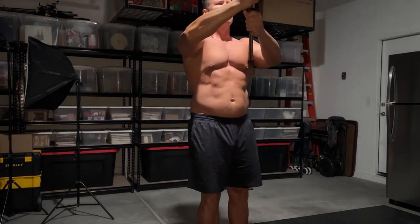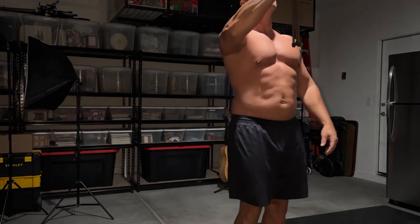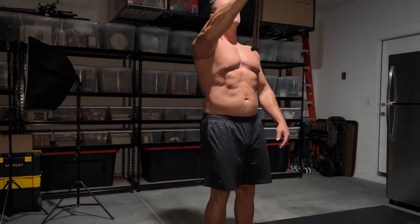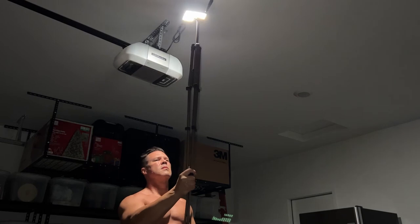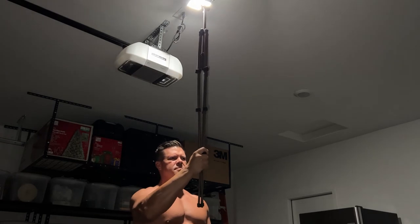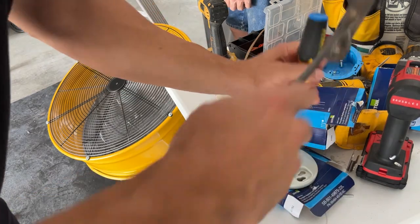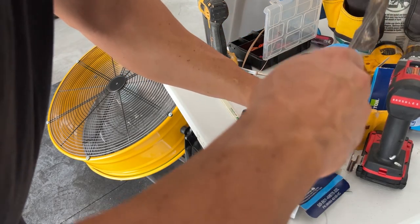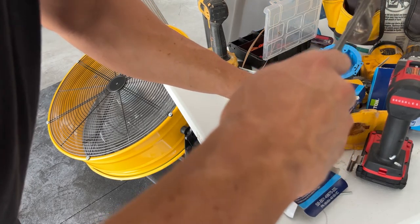The second fixture I placed to give the best possible light when I'm taking progress pics. The third fixture is just for extra light — placed at equal distance between the first two fixtures and midway between the garage door and the line connecting the first two. I also replaced the existing recessed light with a new fixture, giving me four light fixtures total. I decided to keep it cheap and simple: porcelain fixtures at $3 each, with a low profile so my garage door could still open. I like the retro, simple look they gave me.